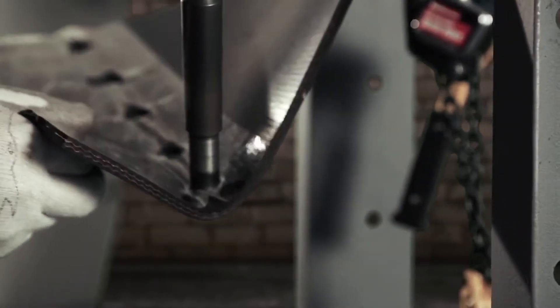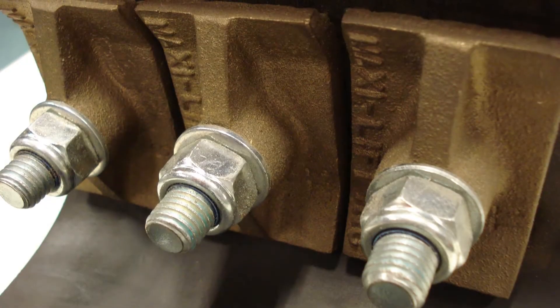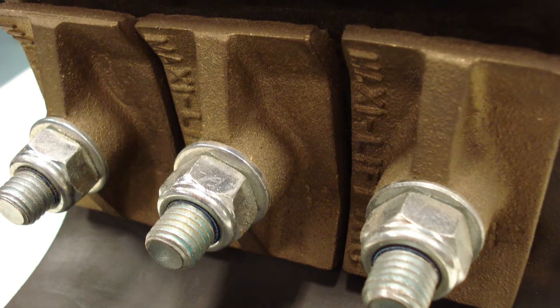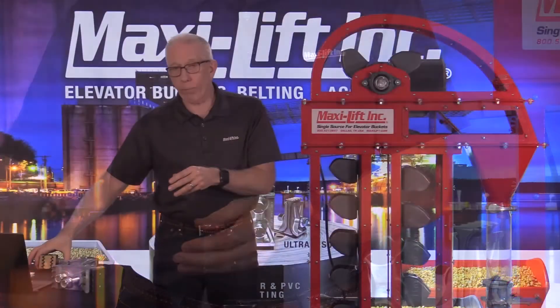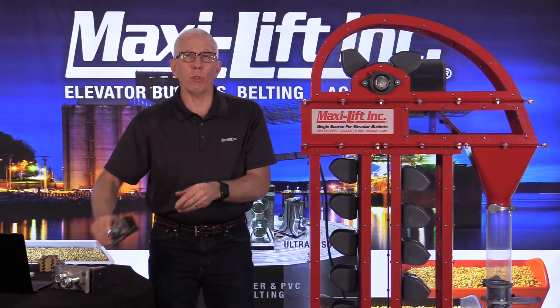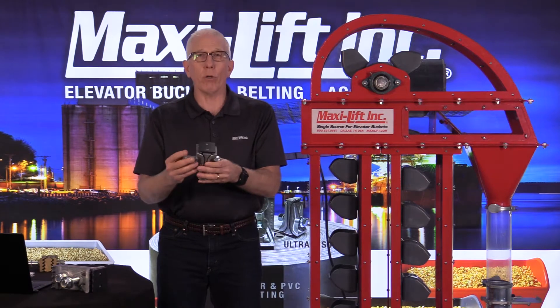This is going to match up exactly the way you need it. It's two inches wide, so a 20-inch wide belt is going to take 10 of these — you know exactly it's going to be the right amount. If you've got a heavier belt, say on an 800 PIW belt, you would rather use a heavier duty splice.